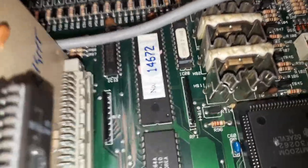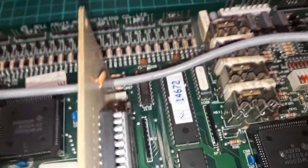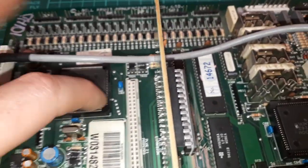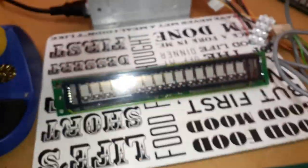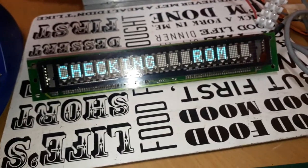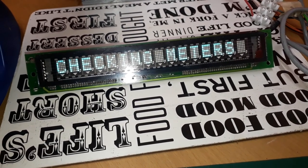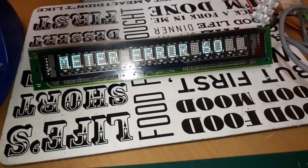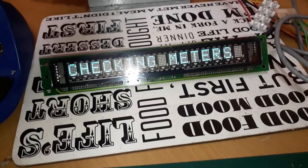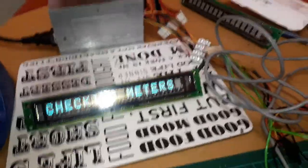And it should have come to pin 19 on the processor, and it didn't. Check the other corresponding pins around there. Check A12, which is the first one. It went to the processor. Went up one, it went to the processor. A11 didn't. And I put a wire link on it. And boom. Board works.